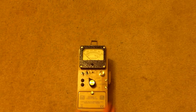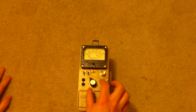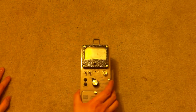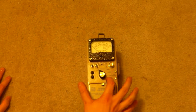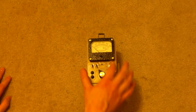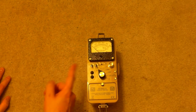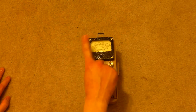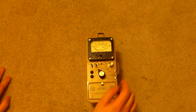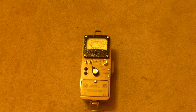Now, let's go over the actual pieces that are connected to this, then I'll go over the probe that's connected to this. You'll see this has a six-position switch for off, battery, and then four decades, and I'll explain what those do in just a moment. Those adjust the meter here. There's a reset switch and high-voltage switch, audio on and off, and fast or slow acquisition of the high of the actual true reading. We'll connect a probe to this now so that we can see what this actually does.